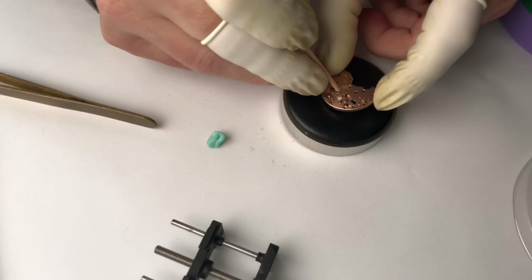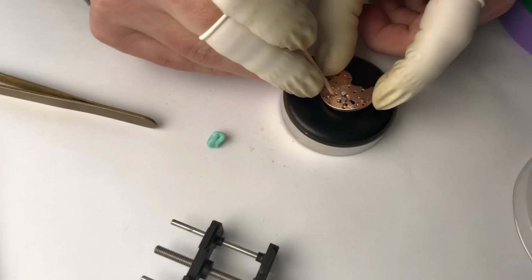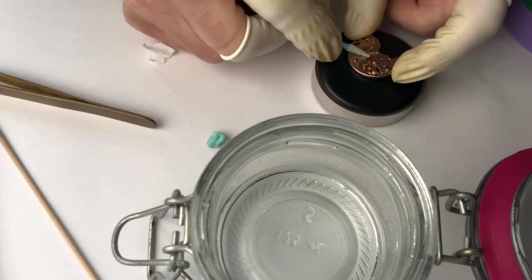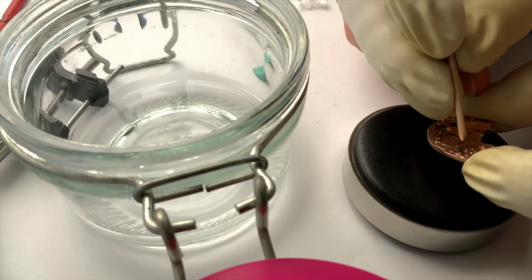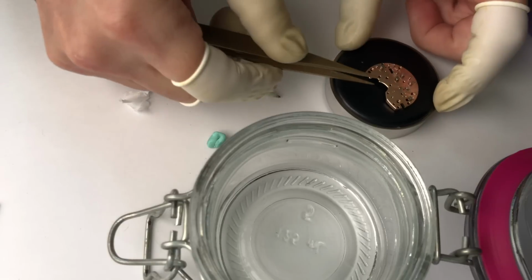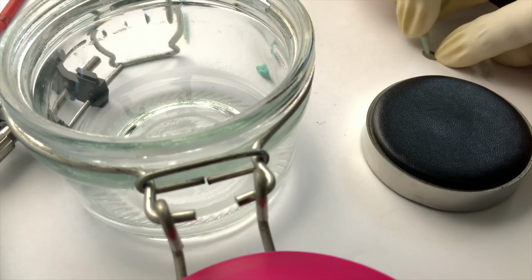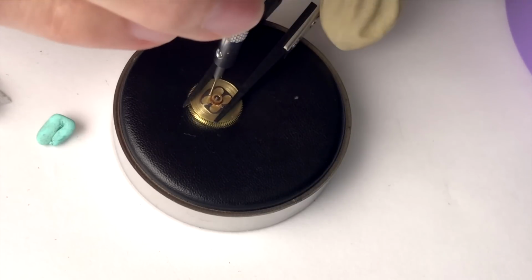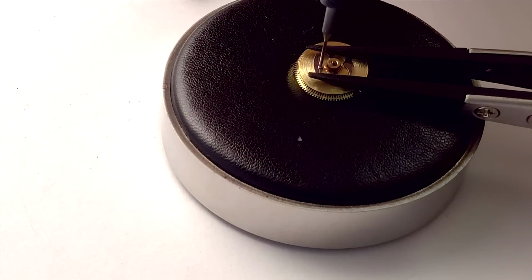A little bit of pegwood to prepare this for cleaning. It's really dried on there. And while I'm at it, I'll use a little isopropyl alcohol, see how much cleaner I can get it. Once I get the big gunk off the parts, I'll get these into the ultrasonic cleaner. I use a non-water system, rinsing in isopropyl alcohol. Check out these tiny little screws on this plate over the barrel.